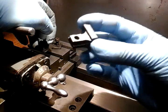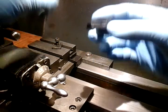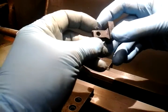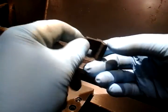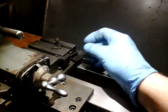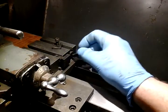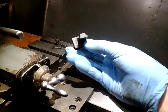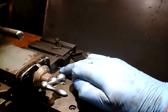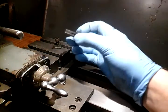I've made this out of some key steel and I'll show you a drawing in a minute. It's just straightforward milling. There's nothing to stop you fabricating this to suit your cross slide - it could be fabricated, made a different shape. I've made it offset for a reason so I can get to my cross slide locking screw which is at the side of it.